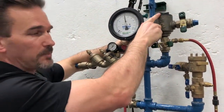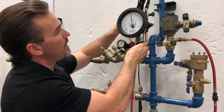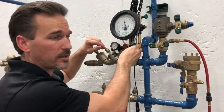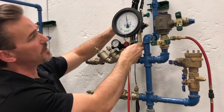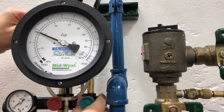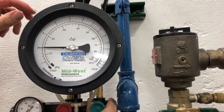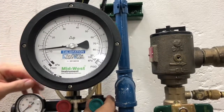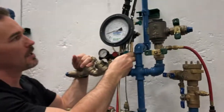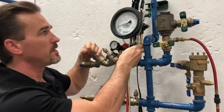Step two is the air inlet valve opening. From here, we're going to open our high side bleed valve — crack it open. When the gauge needle starts to fall, we will watch for water to begin flowing out of our vent valve opening. When we see it starting to do that, we're going to record our gauge reading. So let's crack our high side bleed valve. The gauge needle's falling. We're watching the gauge and watching for water to begin flowing out of the vent valve opening. The air inlet valve opened right at 1.6. This is a good gauge reading because our minimum is 1.0. This SVB passed the test because the reading we got for our check valve is greater than the reading we got for our air inlet valve.